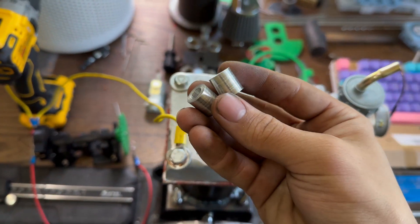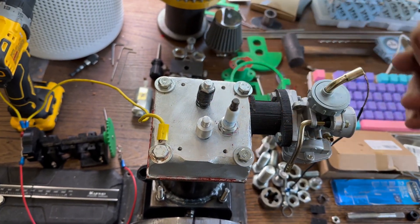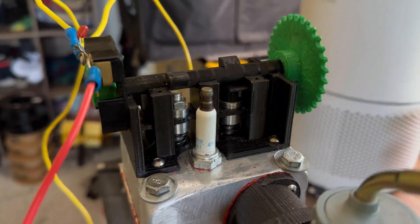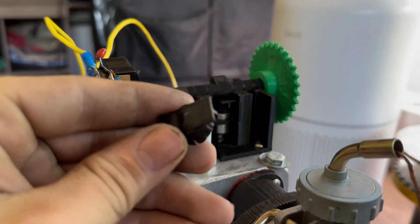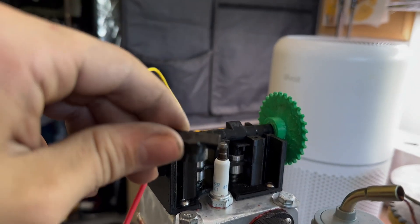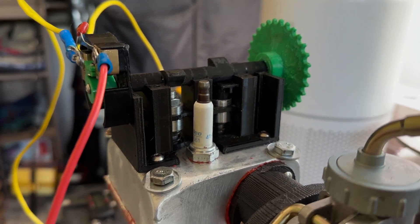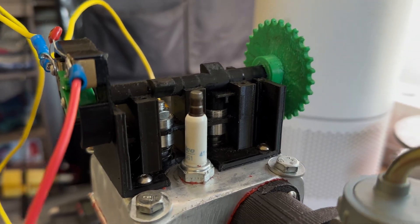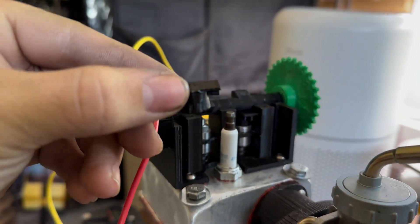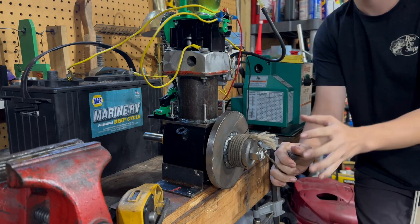What I just made on my lathe are these two pieces — they're going to replace the originals. They go over the top and won't melt because they're aluminum. So there it is with the aluminum valve spring retainers. On the other one, the locked-up exhaust valve smashed it down, so I have to re-3D print that. Then it's ready to test. I'm guessing it should run until the piston melts a hole through it, which should be another minute or two.